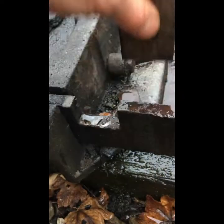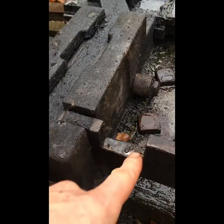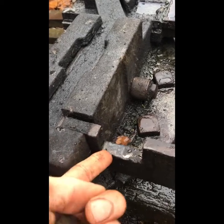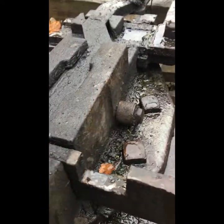Go up to that lip — that's where you sit it on the rail. The lip goes all the way across, and that gives you your mark to cut your FPL, your facing point lock. You'll find that you've already got half a notch already cut out, which allows you to get your hacksaw down and across. In reality, you'll take a little bit off the bottom and a chunk out, and that will give you your facing point lock notch.